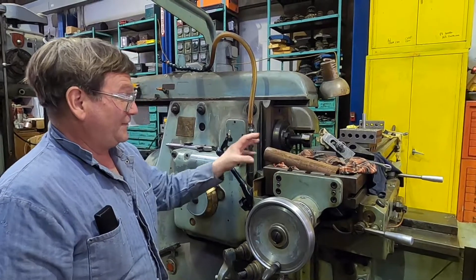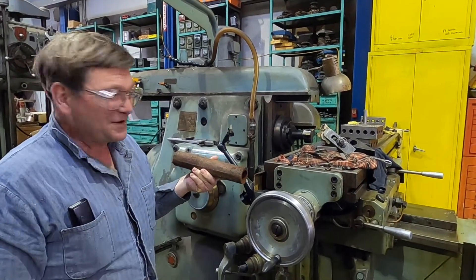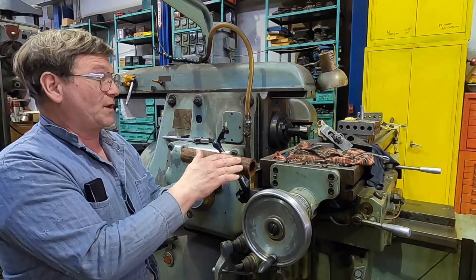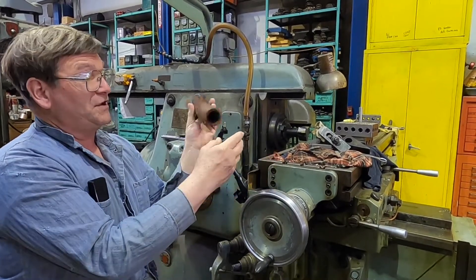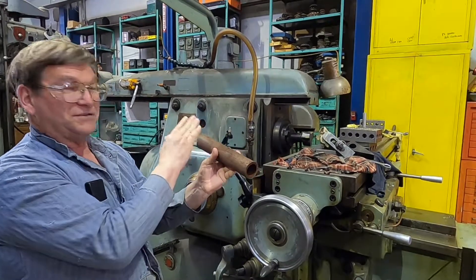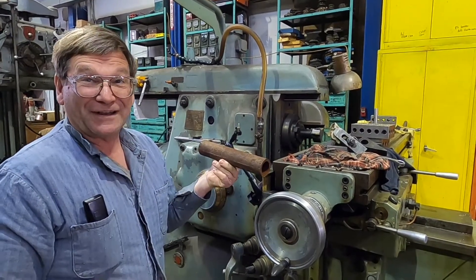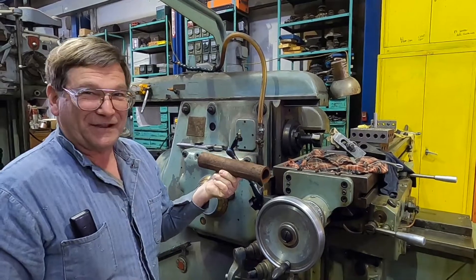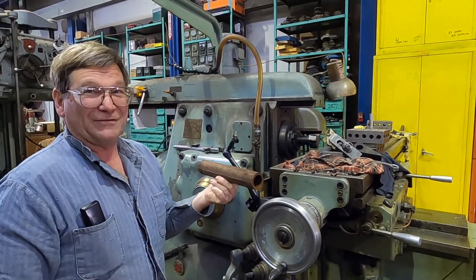We can imagine the only way to make a spindle is by making it perfect with perfect bearings — but even with perfect bearings, it's not perfect. There is always going to be some error. There's also some inaccuracy when the two bearing surfaces are machined together at once. Turn it around and do the other two, and now we're not dead in line. This also presumes the machine we did them on is perfect with absolutely no run-out. Even the fanciest, newest machine has some inaccuracy.